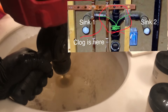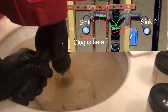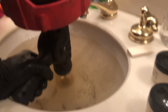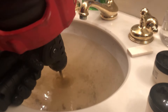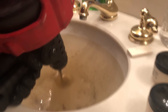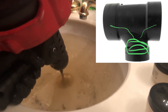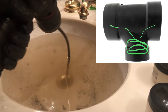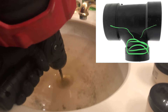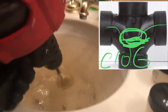You can shoot it fast and hopefully catch it, but you definitely want to shoot it slower than before. You'll see in this video, I end up just inching it down inch by inch — that's really the best and only way to get down those tees sometimes. Sometimes the way these places are built, they put no directional drain lines in. They've got flat tees straight across, so the plumber who comes to unclog it is gonna hit that clog and shoot right back up to the other side. Even an experienced plumber is gonna have a tough time with Jack and Jill drains.